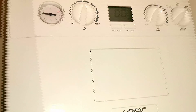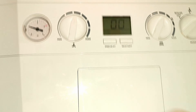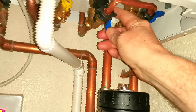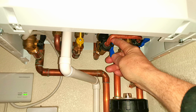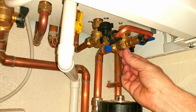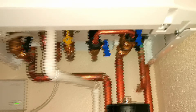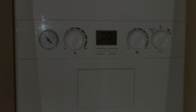Once both valves are open, water will start entering the boiler. Do this gently while keeping an eye on the pressure gauge — you don't want to put too much pressure in. Keep your hand on the valve handle so you can close it quickly. Once the pressure gauge reaches 1 bar, keep going gently until it reaches 1.5 bar, then close that valve and close the other valve as well. As you're topping the boiler up, you'll also hear a little bit of water noise as the water goes in.